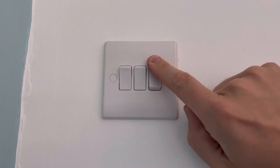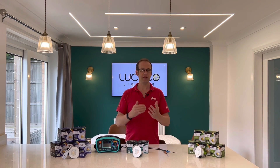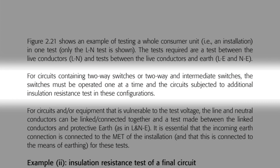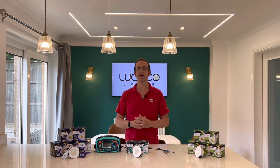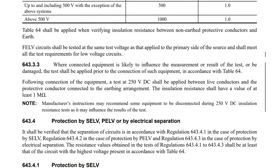So what is the correct process? Can we just turn the lights off at the local switch and view it as a limitation that we can't test the insulation on the conductors after that point? Not really. We want to test as much of the insulation as is possible. There's even guidance on operating the switches on two-way circuits to make sure we're not missing the insulation on the strappers between switches. So to carry out the test properly on lighting circuits with fully contained downlights, we need to follow the direction in Regulation 643.3.3.